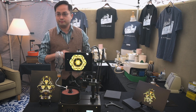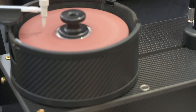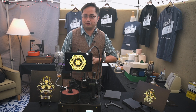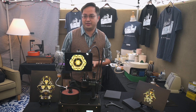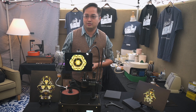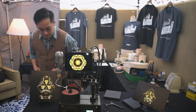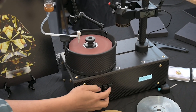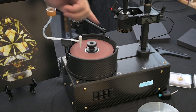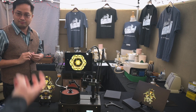What's the RPM minimum and maximum? In this machine the real RPM measurement goes to 3000 RPM, but for us that's too dangerous. So we control the function and right now it's limited to 1000 RPM. Usually when cutting we just work lower than 500 RPM, so 1000 is totally enough. There's also another button that flips it the other direction — you can go forwards and backwards. It will stop for two seconds and then turn counterclockwise. So there's no chance of damaging the motor; it's computer controlled.